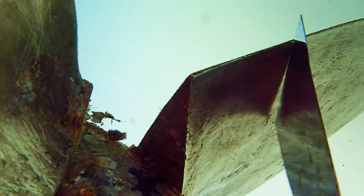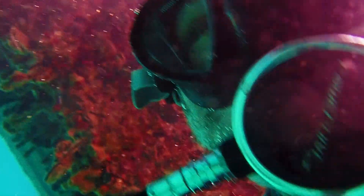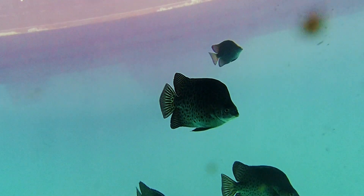I spent enough time down there to actually finish the prop off and make it look like new. One of the things we've been thinking about is whether to use prop speed or not. The jury's out, although I have spoken to a number of people who say it does work. I think the reason why we ducked out of it when we hauled out last time was the expense — you really need to go halves with another yachtie because you have to buy it in a certain amount, and that's enough to paint your prop three or four times. Whilst we're in tropical waters, we can continue to dive down and scrape the prop, but as we go into colder climates, putting on something like prop speed is probably a good idea.